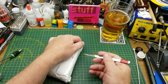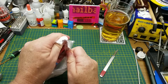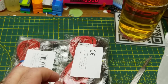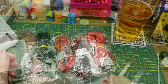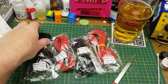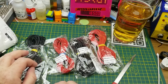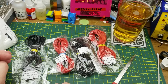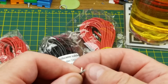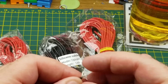Next thing in — again no customs label but it looks like it has a few layers of label on it. Let's see what we've got. Wire — red and black wire. We've got silicone wire in 18 gauge and 20 gauge, five meters of each. It is actually a real silicone wire this time, not vinyl coated pretending to be silicone. A quick check confirms it's behaving like tinned copper — not aluminum. Very nice.